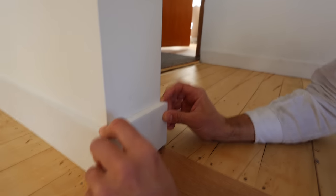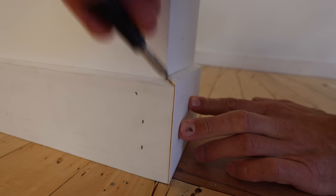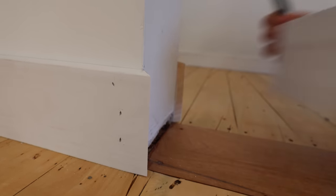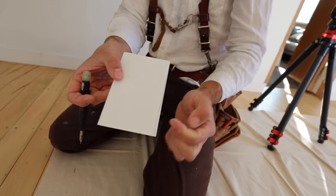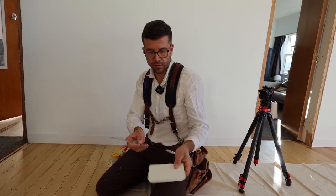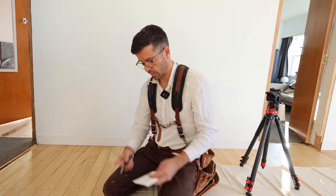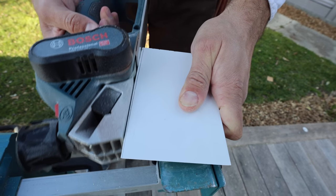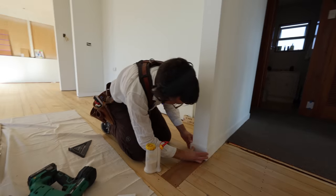What's that bottom doing? See, I'm higher than I need to be on both. How do you know that pulling the pencil on the bottom like that is the correct measurement? It's not the correct measurement — it's more about getting a parallel line. For instance, if I follow that pencil line, that's actually too much to take off. But at least I've got a parallel line to cut to. This is how much I need to take off the bottom — about two mil on the top there — so as long as my two-mil cut is parallel to that bottom pencil mark, we're good.